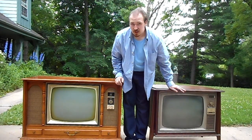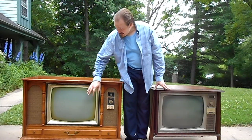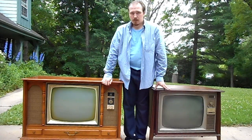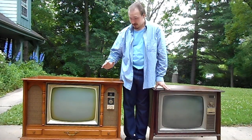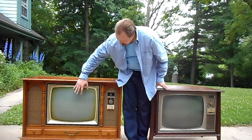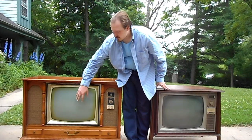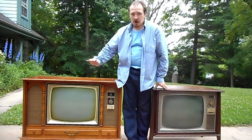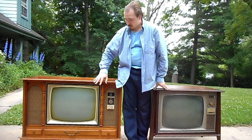Zenith and RCA were the two largest manufacturers of color CRTs in the time period when this style of bonded safety glass was popular. Most of the other smaller manufacturers usually conform to one type or another and can be dealt with using the methods of one style or the other. Zenith style is my favorite to deal with because it's so easy to work with. Basically, in any temperature, you can take a cold steel guitar string and slice completely through the PVA layer, peel off the old glue once the safety glass has been separated by cutting the glue, and then reattach the safety glass.